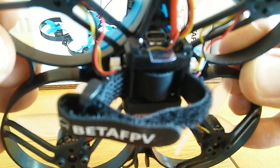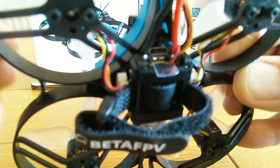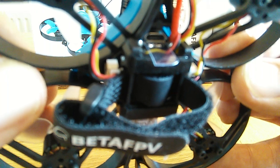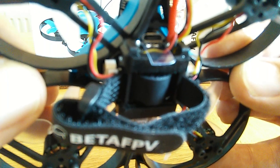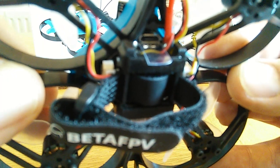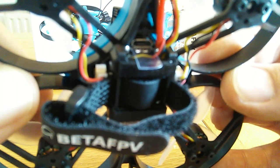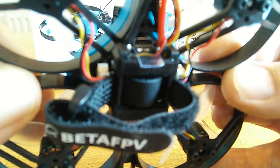So that's probably what the problem is. What I've suggested to BetaFPV is that they add this bit of plastic themselves, but if yours doesn't have it, it's a good idea to add it. I'm going to cut that down and fold it over and glue it in place. You could take it all apart and just cover those connections in glue or some tape, but plastic's pretty strong and resilient, whereas glues could get worn down and tape could get ripped through by the USB socket itself.